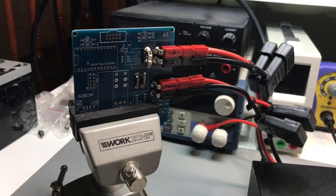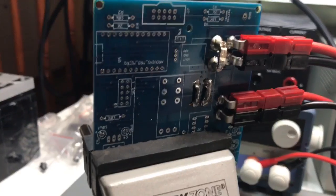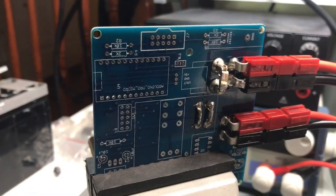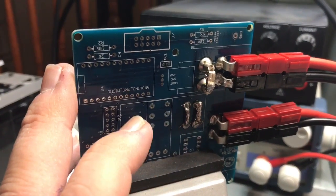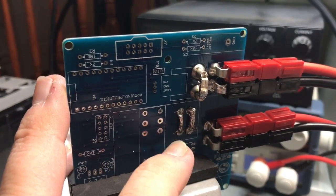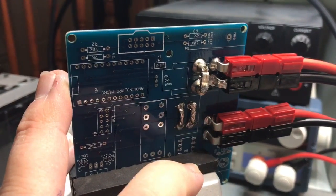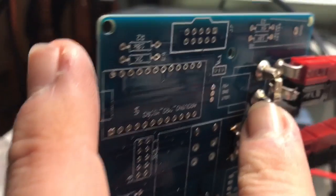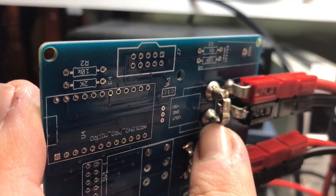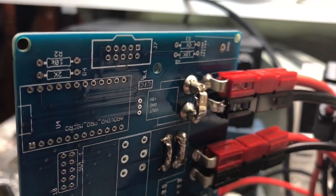This is a very quick and dirty video as I start to test our sample power device board. Instead of installing the relays, I've put jumpers in — tinned wire soldered to the pads with the whole wire tinned. I didn't have any bus wire so I was able to solder in two 30-amp power poles and fold them over and solder them together. This should be good enough.